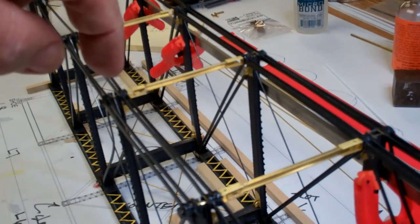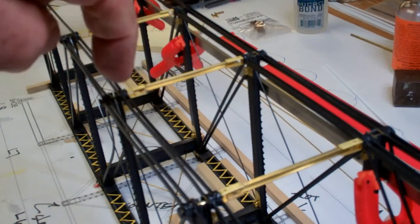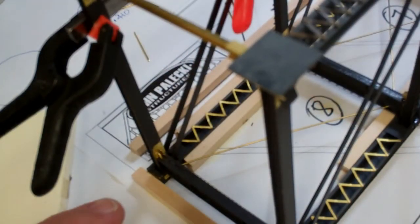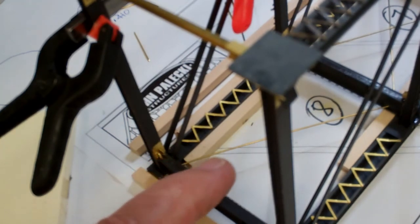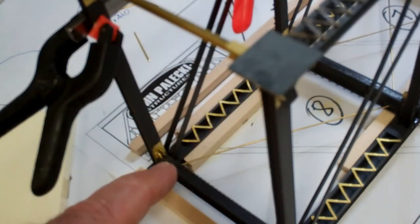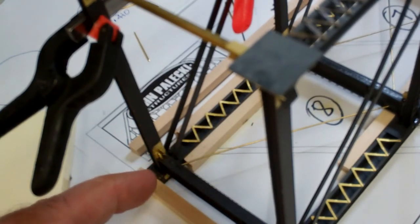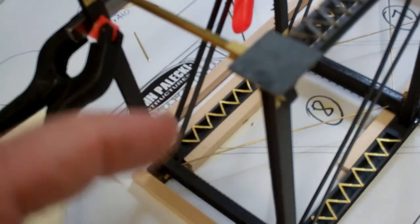And now what we have to do is cut and shape diagonal bars with eyes on the ends of them, so they go into those shoes, and then pin them. Well, we're now at the stage where we have to install a diagonal brace from the shoe down here to the shoe up on the underside of this I-beam. It needs a loop at each end so that it goes around and then through a pin that goes through in here, and we'll pin it at the top, and then another diagonal brace the other way. We'll do each one of these.